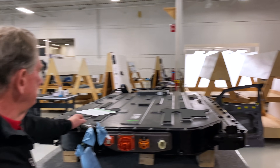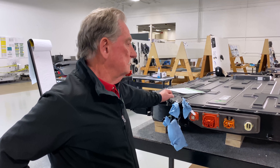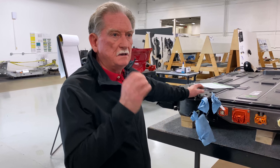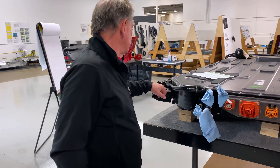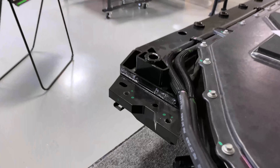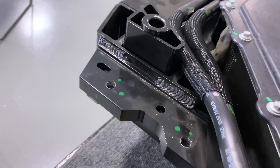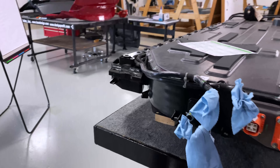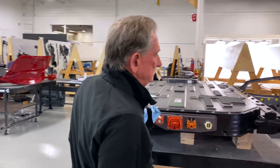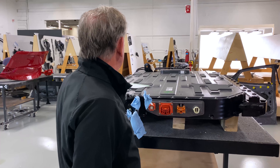I worked in the welding industry for a long time, and that's not what you really want to see. The welds are going to hold up and everything, but usually what I want to see is consistency and accuracy — I want to watch how it puddles. These ones on this side are pretty good, but the ones on the other side are just not consistent. I like consistency because consistency means high quality continuously. So whoever is programming that side needs to go back and correct that.